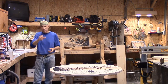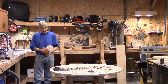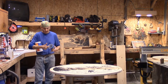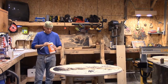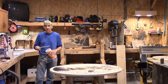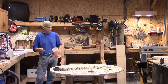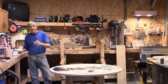We're going to pause real quick so I can mix the epoxy. I'm using an old Clorox container from the recycling bin rather than a Solo cup — in a Solo cup you've got ridges, walls, nooks, and crannies where chemicals can hide. I use a bucket with very smooth sides and a completely smooth flat bottom, because you're going to sit here and stir for two to three minutes to get it thoroughly mixed. When we come back, we're going to start pouring, and I'll walk you through the steps. We've also got a big tarp down.